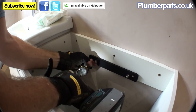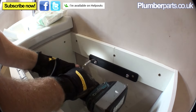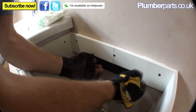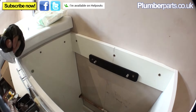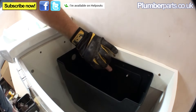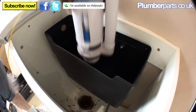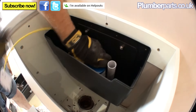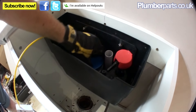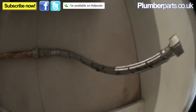We're just trying to leave enough space for your lid to go on afterwards. Now that we've got that on, we can unscrew these two nuts here and actually pop our flush unit in. So while we're here, we can just get our flush unit put in — get that all tightened up and in. Boom — we've got our flush unit in, we've got our fill valve in, and we've got a little braided hose just down here to do up as well.